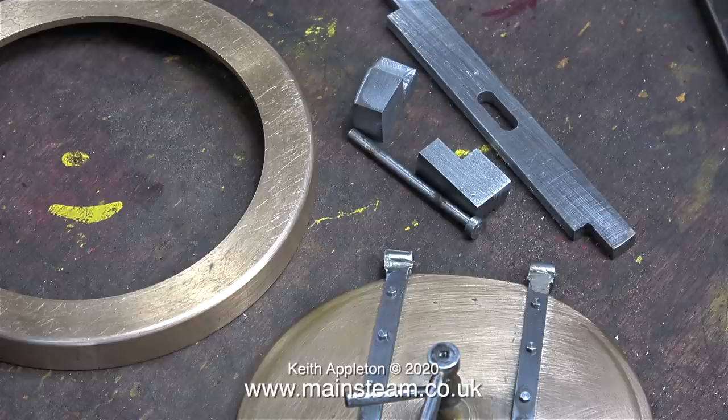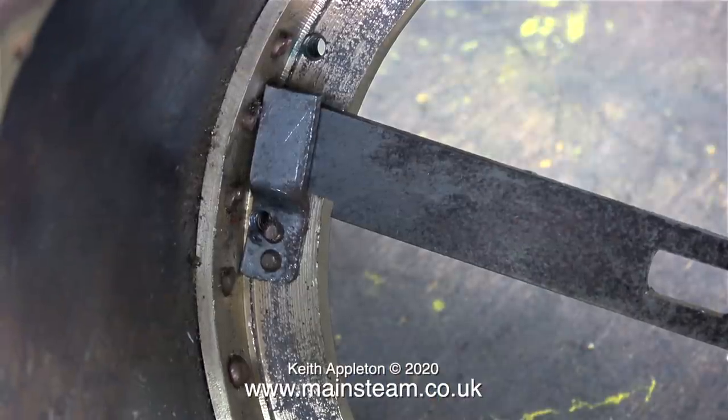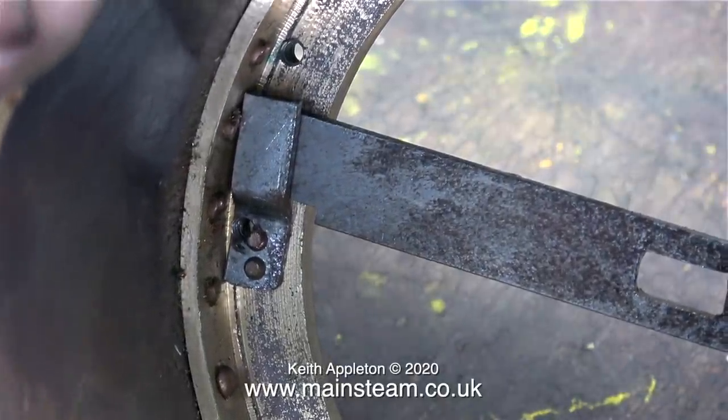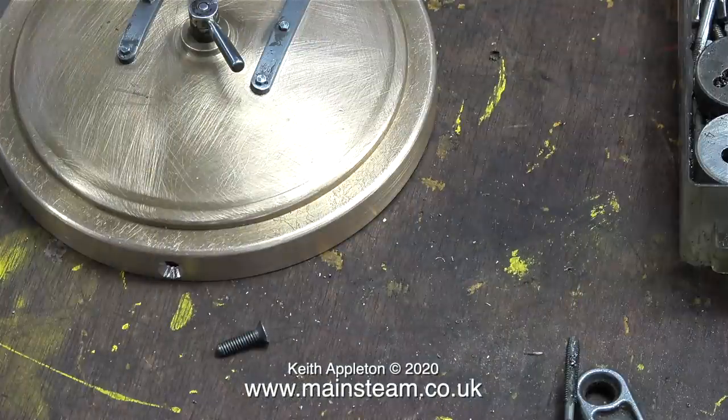But this is not the only way to do the job. Have a look at the previous smokebox that came with the boiler — this just uses two pieces of bent steel riveted to the smokebox ring, one at each side. There are no rules here; just make the crossbar and clamps however you want to do it. And it's a very good exercise for the calibrated eye, because to be honest, I didn't do much measuring at all. It's good what you can do with a small felt tip pen with a bit of practice.